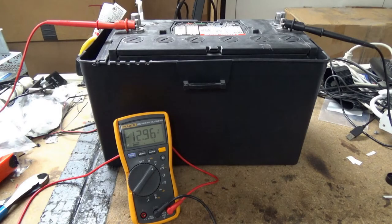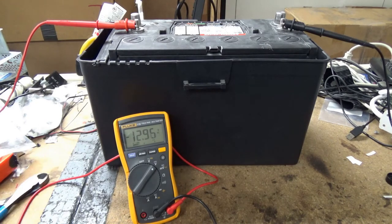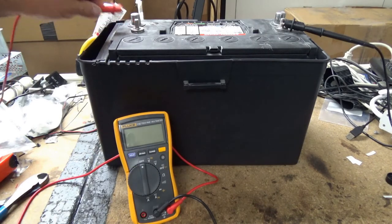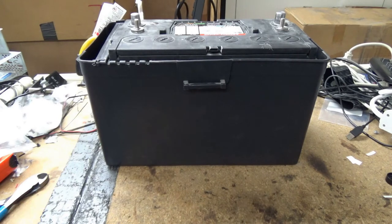Okay, we're back, and it's actually been a couple of hours. You notice we're down under 13 volts, and that's where I wanted to be — I wanted this thing to equalize and rest for a little while after that long charge to get it up to full charge. So we're going to go ahead and take off our meter here and begin to prep for testing the battery.